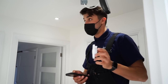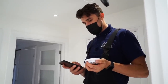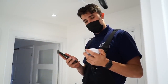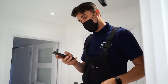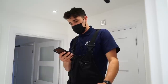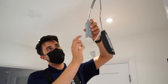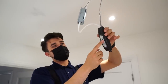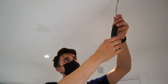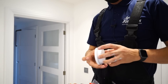I'm just pairing the motion sensor to this device. I've done exactly the same thing - found it inside the app under motion sensor, paired it and assigned it to this room. Now I can edit the device and control exactly what I want it to do. I've wired this up - I've got my loop in and loop out which was going to the PIR through this WAGO box here, then out of the WAGO box through the Lutron dimmer, which I've already programmed.